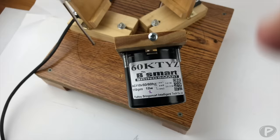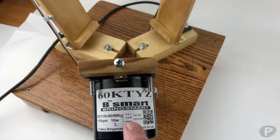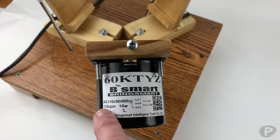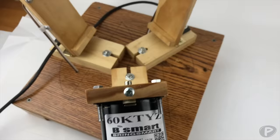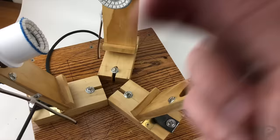To make this machine, the first thing you're going to need are electric motors. You will need three of them and they all need to be the same size and spin at the same RPMs. This is the brand I got off Amazon — twenty-five dollars each, a hundred and ten RPMs, and they are AC motors so I can just plug them into a house outlet. You can get larger ones if you want; I just didn't want the RPMs so fast that the stone flies out.